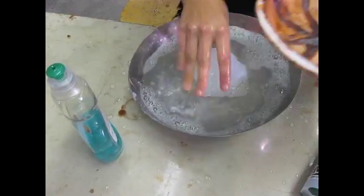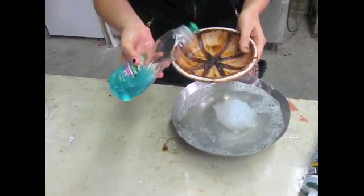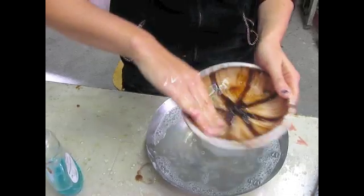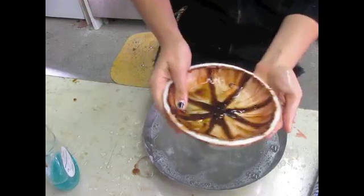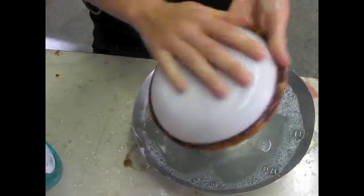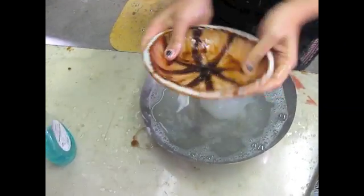While that sits a little longer, I'm going to coat my object with the mold release so it easily comes out and the silicone does not get stuck to it. That is the easiest way to ruin any silicone mold. Just coat it up — the more the better. Make sure you get everywhere. Don't be cheap with the mixture.